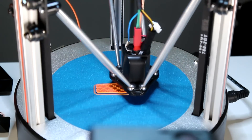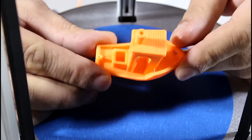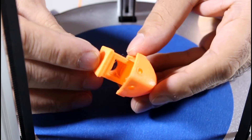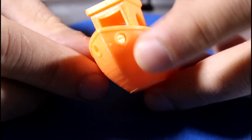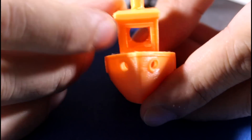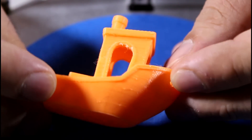It's running pretty nice and fast. Let's see if it's good all the way. To my beginner's eyes it's a pretty acceptable fast printing quality. There are some fuzzes and imperfections here and there. Let me clean it up a little bit. Yeah, it's not too bad for a fast print. See how well it handled those holes. 3D printers usually have problems with small features like this, or overhangs like that one. There are some layer issues around here, maybe some overhang problems there, but in general it's pretty clean.